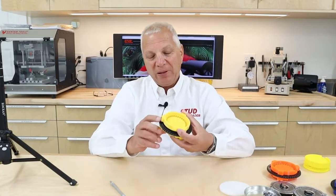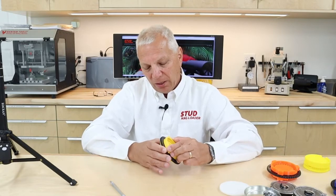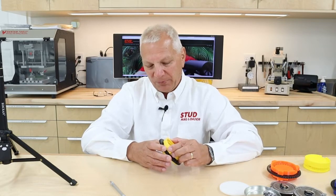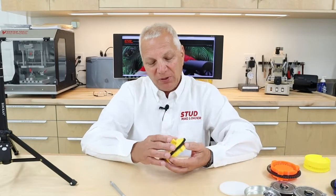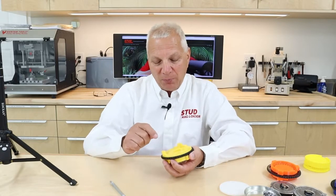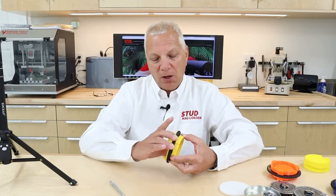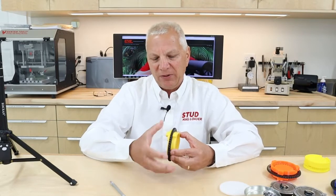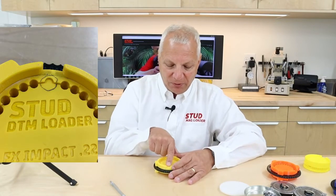There are three main components of the product. There's a black elevating ring, and if you look from the side you can see three ramps - one here, one here, and one here. When you rotate this ring, three radial ramps engage with the top outer section and perfectly lift it straight up. Three points, just like a stool - when you move it with three points it stays perfectly parallel and tracks really beautifully. The reason it doesn't rotate freely: we have three socket head cap screws used as alignment pins, and inside the heads of those are custom springs that cause the product to retract to full position with a really nice, satisfying feel.